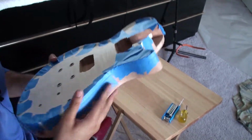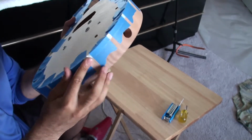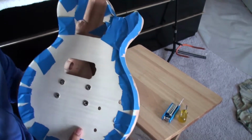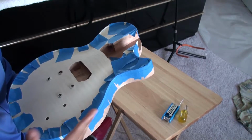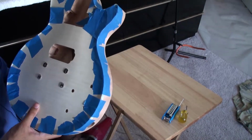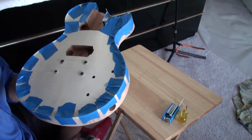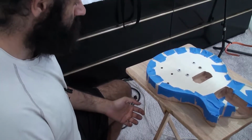And so again, running my finger along the binding and the guitar body, there's definitely a bit of a difference. Both bindings are 1.5 millimeters in thickness, but of course when I took the old binding out, there's some glue residue still in the channel. So tomorrow I'm going to make sure I really go in there and scrape it out, and then hopefully I'll get a buddy to come help me put this on, because 4 sets of hands are definitely a lot better than 2.